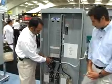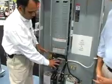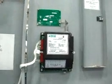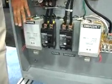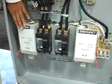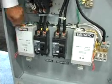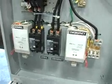Correct, it's very low maintenance. When you need to do any debugging or testing, you just need to test the power transfer switch. It has electronic controls, so anything that goes wrong with it, the electronic controls keeps record of it. The breakers are easy to change out if there's a problem. If there's a lightning strike, the surge suppression will protect the equipment so that the downstream products are not affected, and then you can change out the surge suppression just by unplugging the bolts and disconnecting the cables.